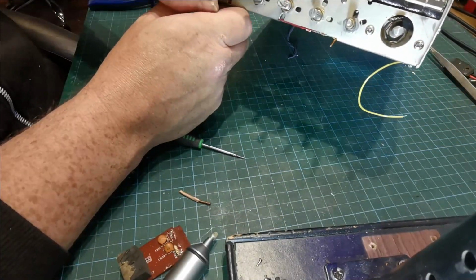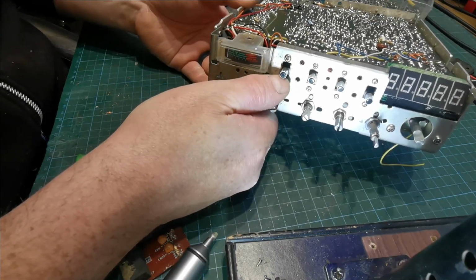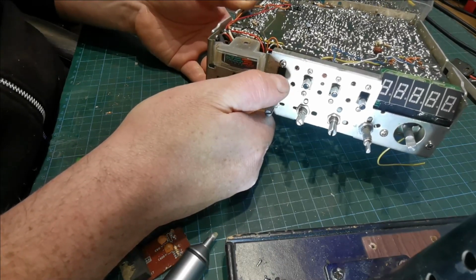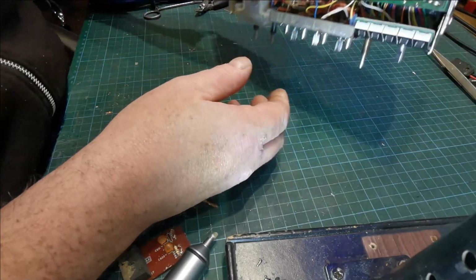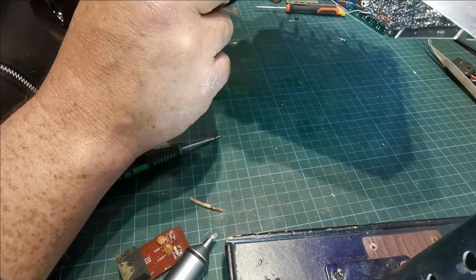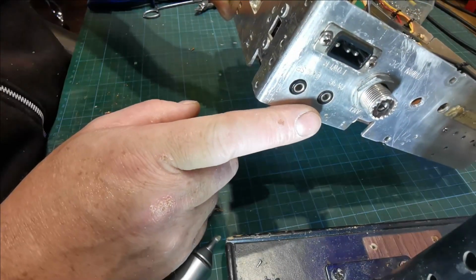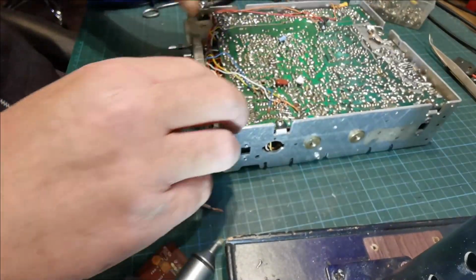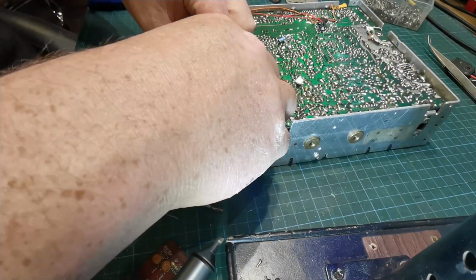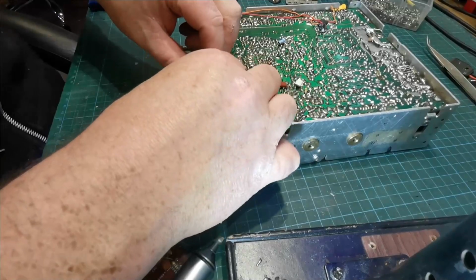So what I'll do with this switch here is what I normally do. I use this for internal and external signal meter, and what I'll probably do is I'll disable the PA jack and use that for external speaker. So when you flip the switch, it'll put the output to the signal meter down to that connector.